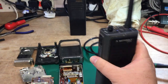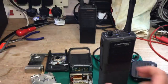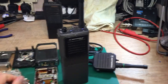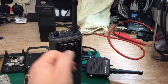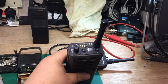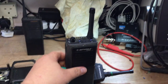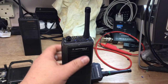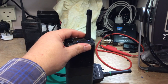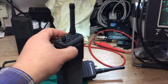The ClearTone CH150 was smaller and lighter — the Motorola is going on for just under a kilo in weight. They also made a remote speaker microphone for the CH150. It was very loud on receive and the transmit speech was excellent. The transmitter did two watts RF output power on UHF, with a band of 438 to 470 MHz.